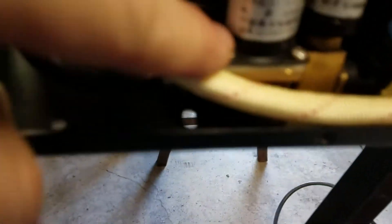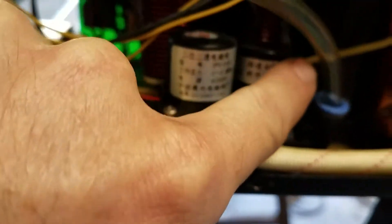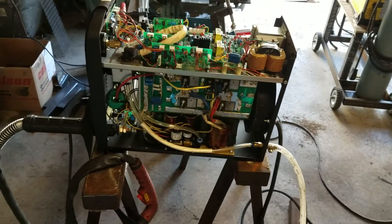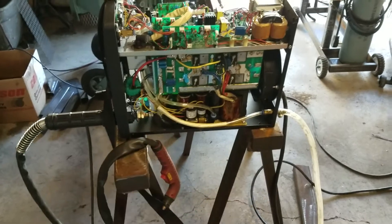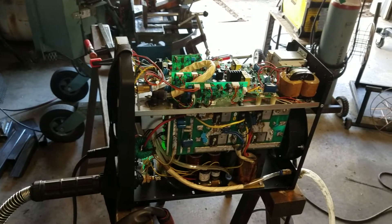From the bottom of the machine there are two screws — your machine might be different — but those two screws come off and you can move this thing out of the way. Then you take these four screws off the larger chamber — there are two chambers, this one has screws, this one doesn't. There's a little bullet-looking plunger with a rubber side and a spring inside, like a poppet spring. All I did was pull that spring out and lengthen it by maybe a sixteenth of an inch — it's a tiny spring, maybe three-quarters of an inch long, no more than an eighth inch in diameter.